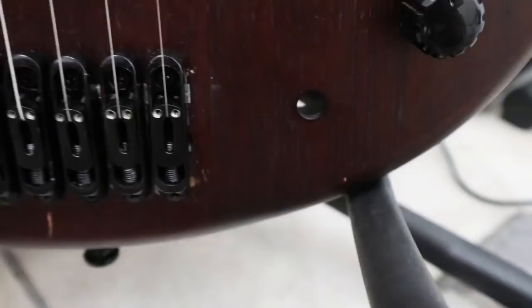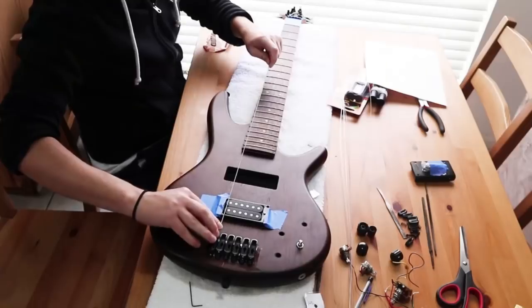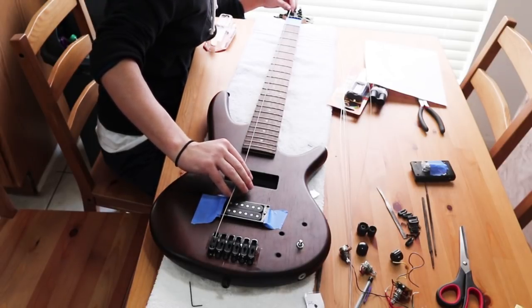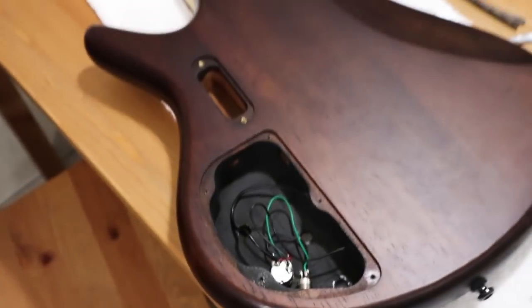Not nearly wide enough. I knew it wasn't going to be perfect and was using a fairly wide string spacing, but I drastically underestimated how far the strings would spill over. Should have done some actual measuring when thinking this through. If you put it dead center, it still technically picks up the two end strings, just not very well. I can shift the pickup around for now to clearly hear one side of the guitar at a time. I have better solutions in mind, but for now I say let's go ahead and play the thing.